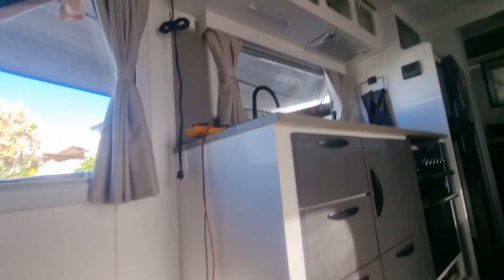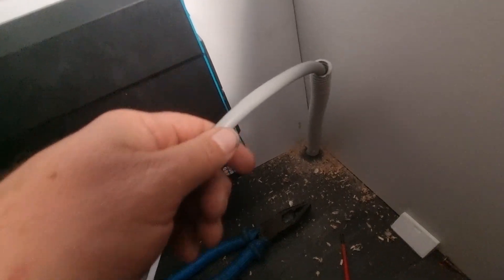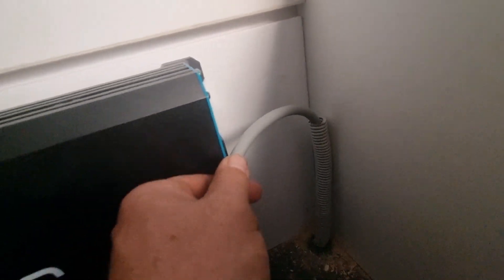I'll paint this area — you can't even notice it now. I'll silicon those holes as a job at the end. Now that we've got the cable all the way through to the switchboard, all the hard bits are done — we just need to fit the plug off. I'm not a fan of Coro; I'd like nice ducting, but this way works. I'll put a little plug here, saddle it up, and it'll go straight into the inverter. I think it'll still look pretty tidy.